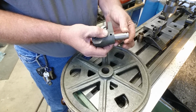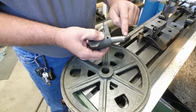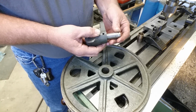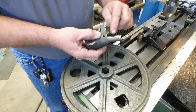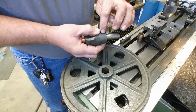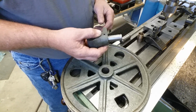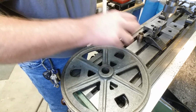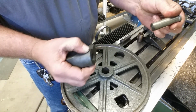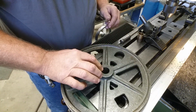Anyways, I need to control my depth before I drill that hole. This was coming out, 1 inch 800 thousandths out of here. So that needs to be a very controlled depth, drilled pin. But I'm going to wait and get my bearings in there first, figure out my thrust and where everything sits. But this is going to need to be bored. That's a pretty nice fit. Love those piston fits. This is going to need to be bored.